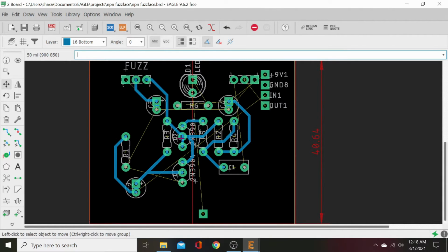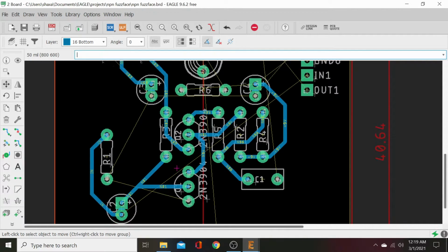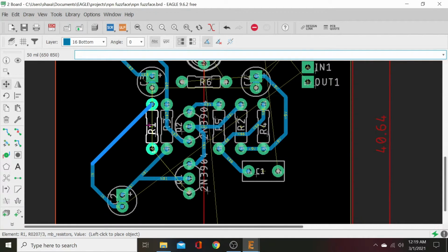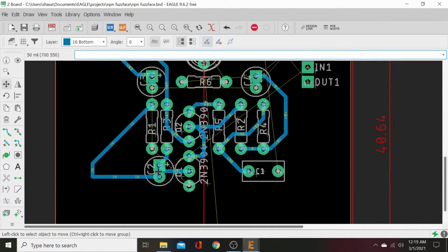We'll move that, stop. Let's grab this trace. We just want that trace. Let's go ahead and scooch it a little more right there. That's pretty. Let's grab this. Scooch it up here. Let's space it. Well, we're going to have to change our grid spacing to do that. Let's move our transistor up just a touch. That's fine. There won't be interaction between that lug, that emitter lug, and that base there. So we'll go ahead and scoot this up. Hey, that's pretty.